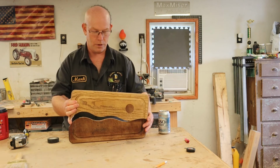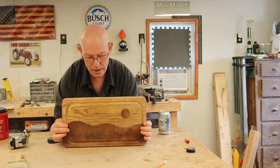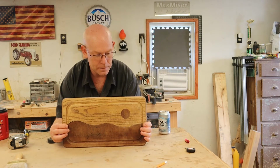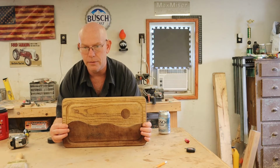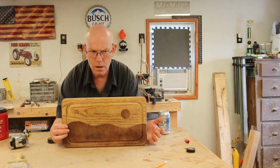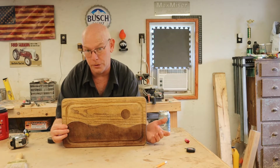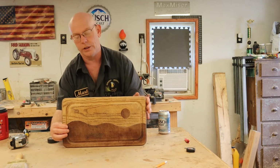Now these, where the veneer is the weak link, but it's a cutting board, not a pounding block. Now, when they glued it back together and it worked, we got another 3 months out of it before the glue failed again, because once you break the glue bond and you try and re-glue back to that glue, you're gluing the glue and you're not getting any penetration into the wood grains. It's not going to hold worth a shit.